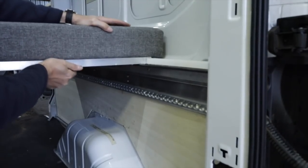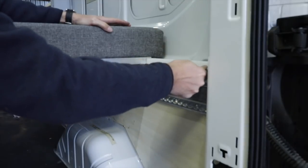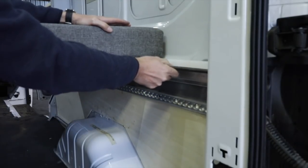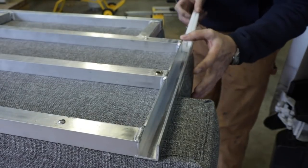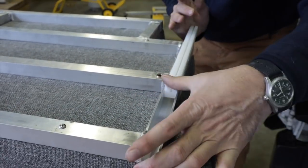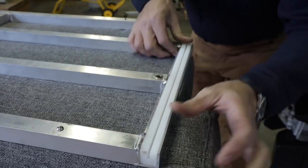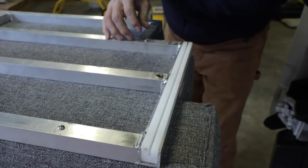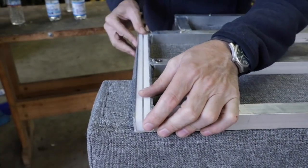I also had her overhang these cushions a quarter of an inch so they're tight — it takes some effort to press them together, but there's no seam or crack you're going to fall into, and no metal coming in contact with each other which would cause a squeak. It's absolutely rock solid, no squeaking. It sits on top of this vinyl C-track. Just worked out so, so good. These bearings fit in here nice and tight so they don't come out — snap right in there.